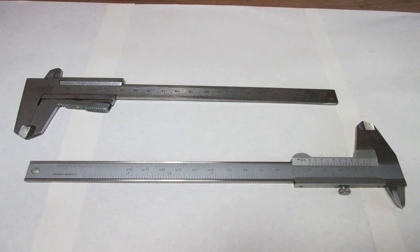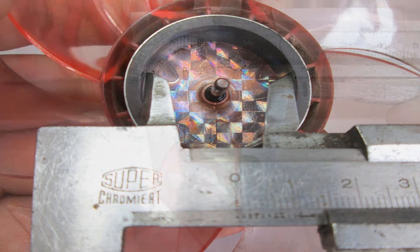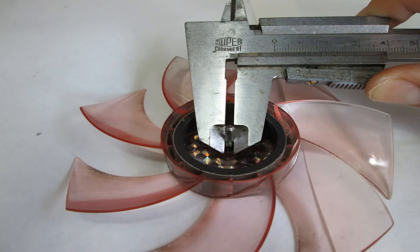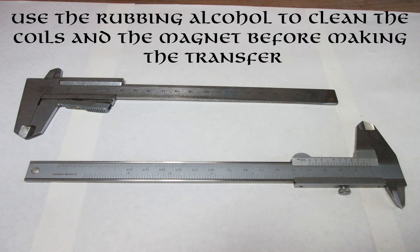Now we will need to make a few measurements with the vernier caliper to determine if the rotors are compatible. The first measurement is the external diameter of the rotor. Next is the internal diameter of the rotor's magnet. After that, the rotor thickness, then the thickness of the axle, then the length of the axle, and finally the position of the slot for the washer. Some of these measurements do have acceptable deviations.